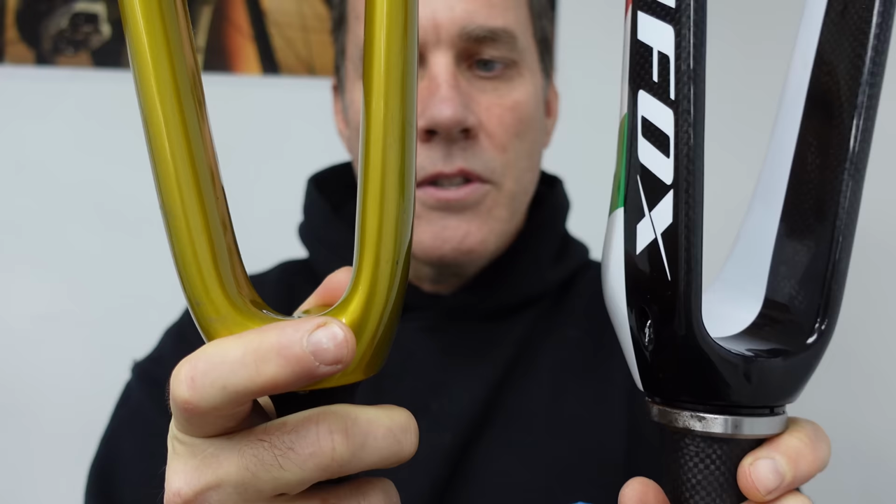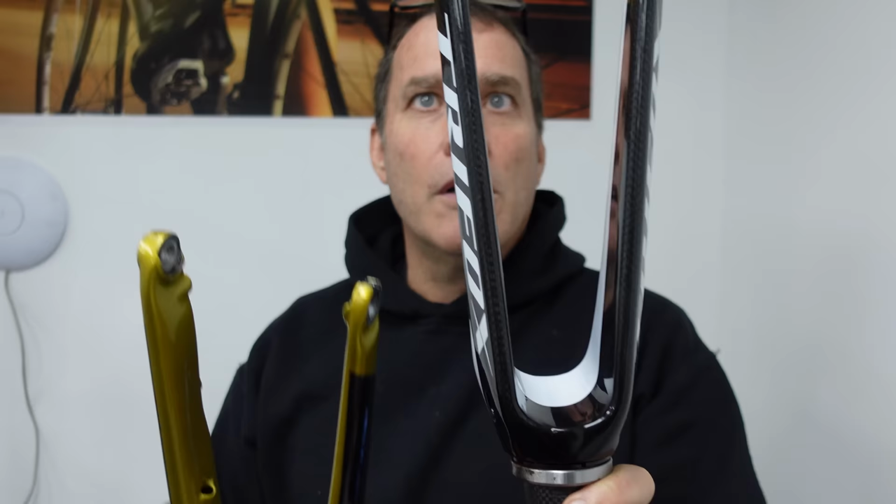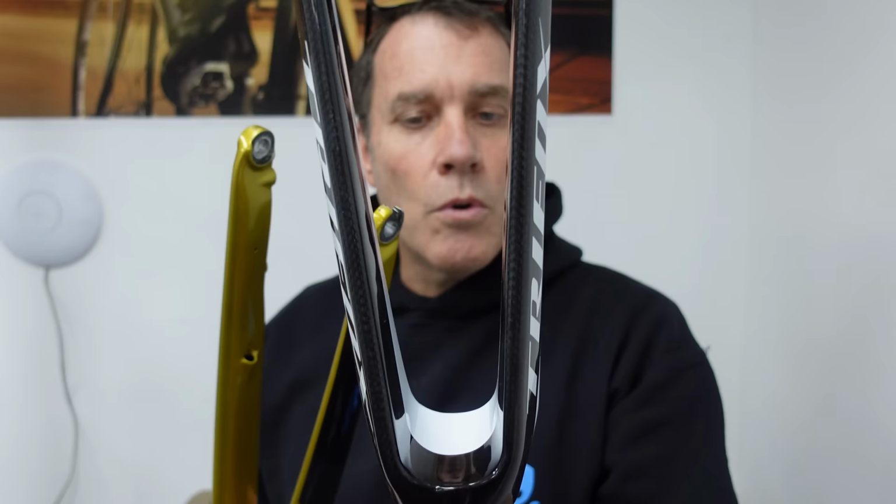So I always say in designs, always look for curve. More gentle radiuses than very tight radiuses like this, because this tends to cause this cantilever effect of a long solid blade. Yes. Cantilevered on a very tight corner. Oh, it makes sense. So, you know, but it depends on what the design is and what thickness wheels you're going to be putting inside this fork.